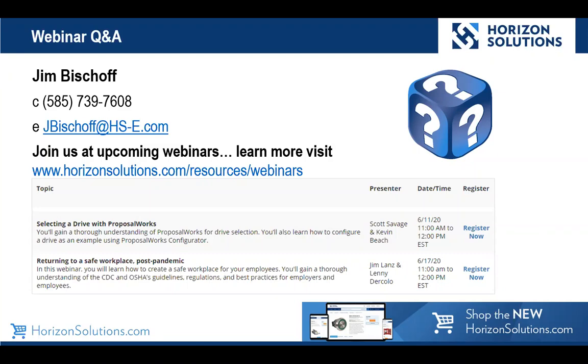Perfect. Another question, how does the number of links affect the response time for evaluating against safety stopping distances? That's a great question. It's an interesting question as well, because series wired devices you would think would be faster. However, depending on what type of device they are, if they are dry contact devices, they will be faster, because now we're just dealing with the speed of electrons. But solid state devices actually have to process an input and retransmit an output. So every OSSD device has a latency time associated with it.